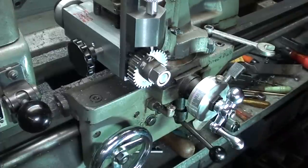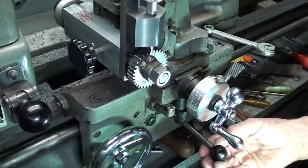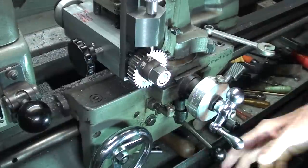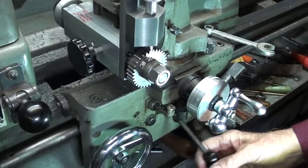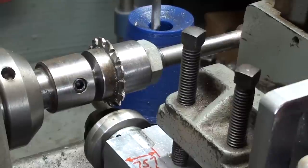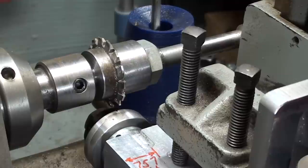Here's another thing you will not be able to see once I start cutting. I am going to use the power cross-feed, which is this lever. So here's a dry run. Check your setup over and over, because finally I'm ready to cut — and you can see there's just an awful lot of preparation work. This machine is louder than a combine — you may not hear me over it — but let's make some chips, finally.